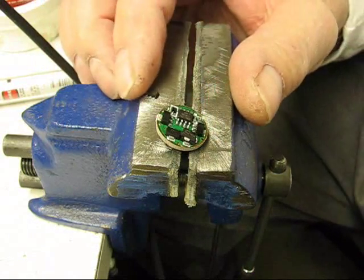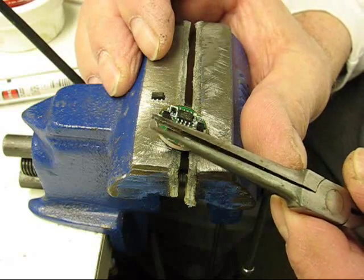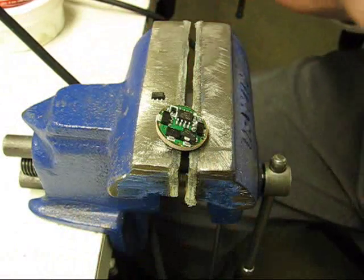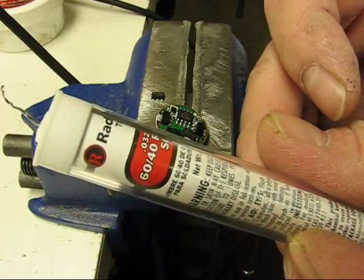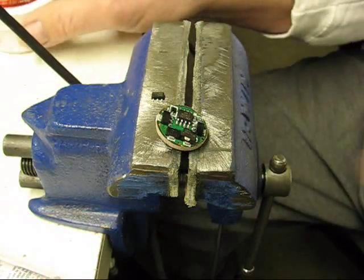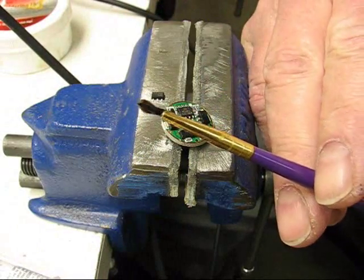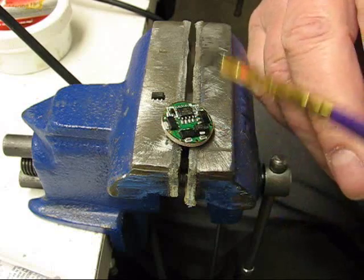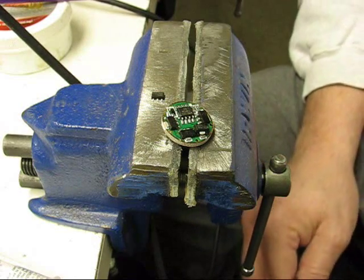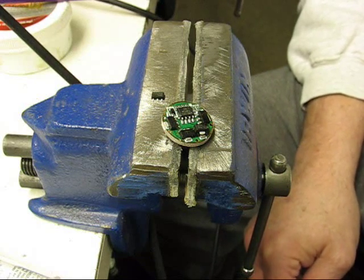So I've got the driver board, I've got a chip, I've got a pair of needle nose pliers — smooth jaw and very small thin needle nose pliers. I have some Radio Shack 60-40 rosin core solder, 032 diameter. I have some soldering flux, some rosin flux, and a real small paint brush which I use to paint on this stuff. The flux is the biggest thing for me. If you put some flux down there and get them coated really good, solder flows on real easy. If you don't, it's just a mess.